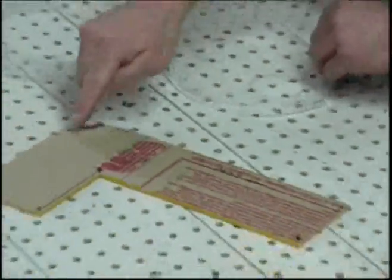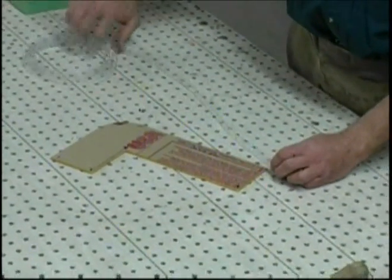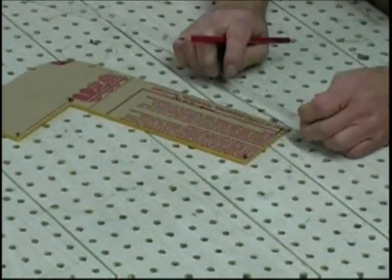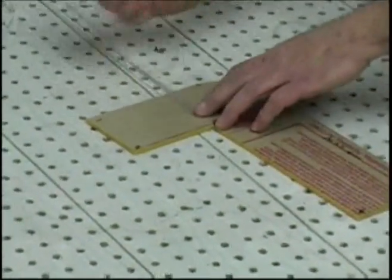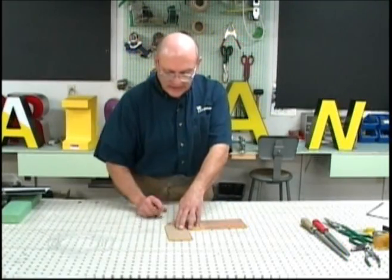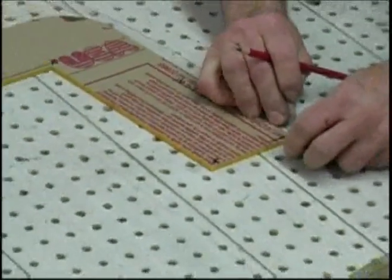And as we measure this letter, we're going to transfer these markings to the butyrate layout tape, and then as accurately as possible, we're going to transfer those measurements to the letter edge. So the first thing that we'll do is take our layout tape and, using our all-surface Stabilo pencil, indicate about a 1-inch tab that will fold over the top of the letter.